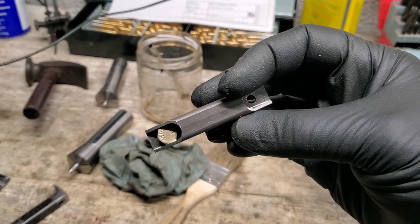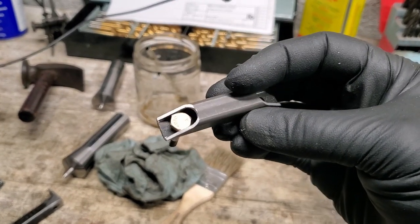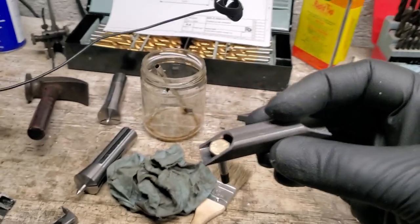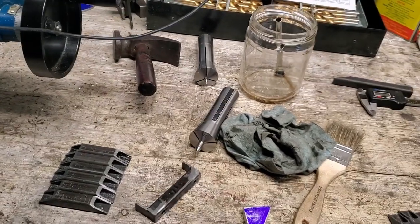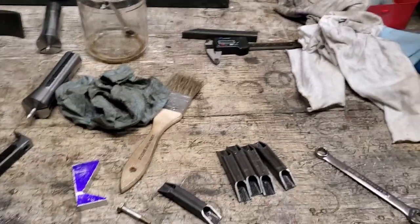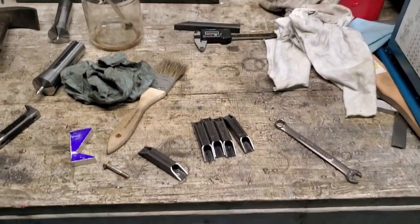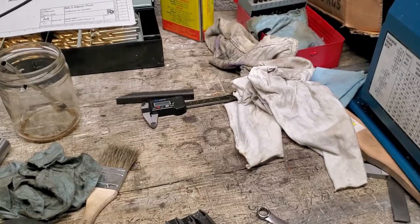This is 4130 half-inch square tubing with 0.065 inch wall. The issue I'm dealing with is that this tubing — the 0.065 wall — is thicker than the 0.049 that is called for in the plans.